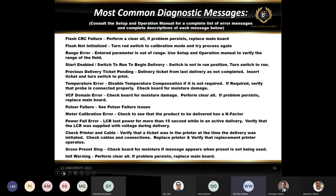Power fail error. Power fail error means that during a delivery, so you've started a delivery, you've had your counter reset, you've pumped some product, and all of a sudden the register loses power. It has to lose power for more than 15 seconds. And if it does that, when you do power the register back up, it's going to automatically end the delivery. It's going to kick the ticket out of the printer if you've got a printer attached to it,